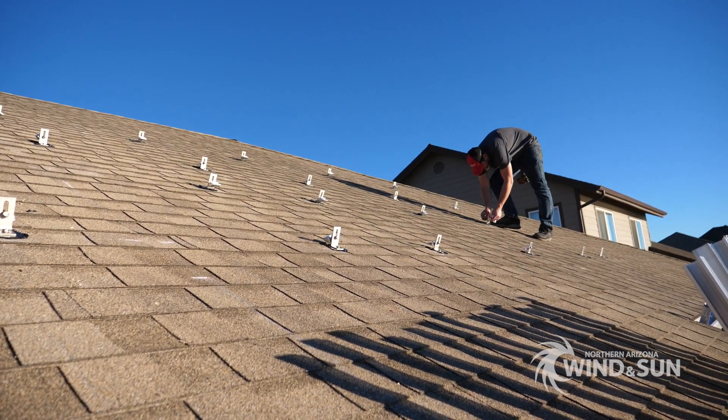We don't have that high of a wind rating here, but the main design constraint for that installation was the 50 PSF snow load, and the 2.3 rail met that target with the 48-inch spacing. So you're going to go ahead and find your rafters and mount your feet.